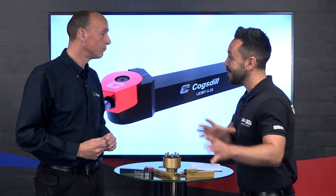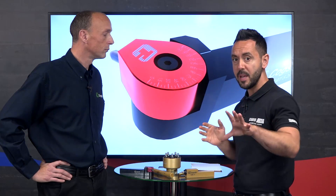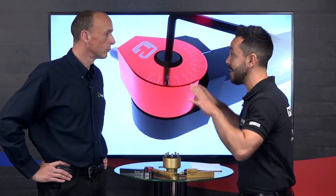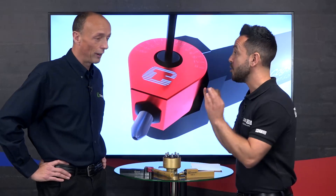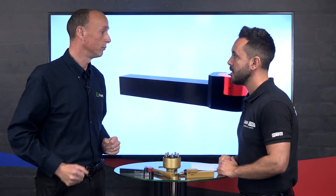It wasn't long ago — about ten years ago — when I was on the shop floor and I wish I'd known about these tools, because I was always chasing surface finish. If I couldn't achieve it on the lathe or mill it would have to go to the grinding section. These products are fantastic and there are new innovations we'll cover in separate technical corners. In a few words for people unfamiliar with burnishing: if you've got a surface finish of 0.4 RA or better that you're fighting to achieve, and you're fighting for size, come to us for burnishing — we've got a tool for the job.